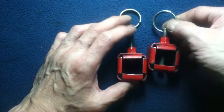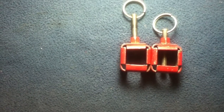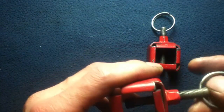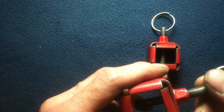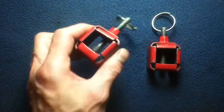These are also easily damaged if you're using particularly a non-standard length barrel, particularly one that is shorter than standard. For example, some of the M4s will have short barrels, some of them even shorter than normal standard, and those will create enough pressure to distort this tube once it's screwed in, causing enough force to move the tube in this direction. But while it's threaded, the only way that it can actually move is by distorting the metal box itself, and that becomes quite apparent.